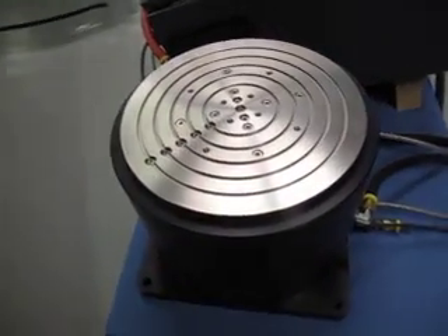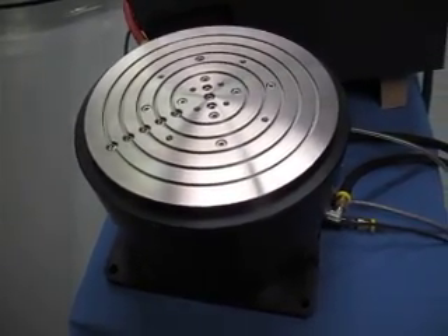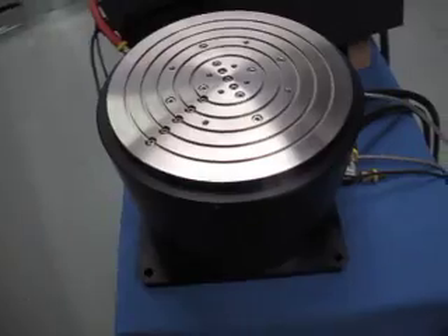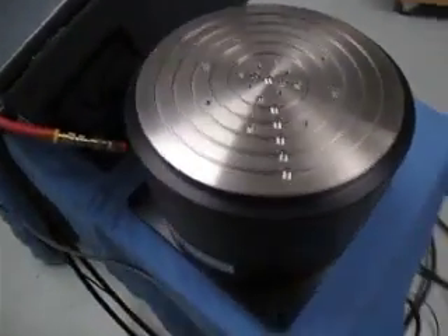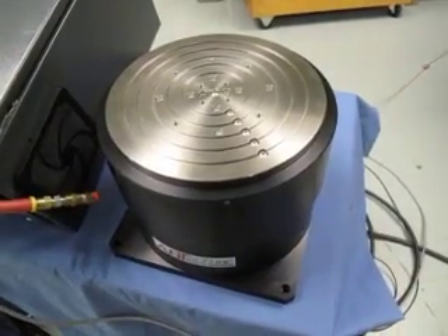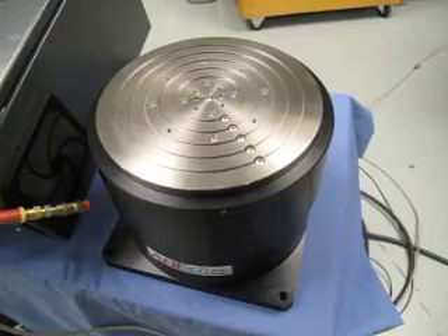This system features an 8-inch diameter AT series dual thrust plate design air bearing made with hardened 440C stainless steel components for durability. Certified axial and radial accuracies of less than 5 micro inches and angular or coning accuracy of less than 1 micro inch per inch were achieved.